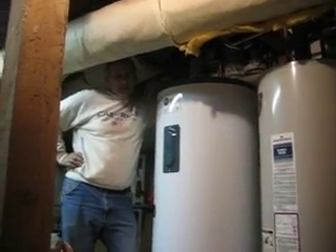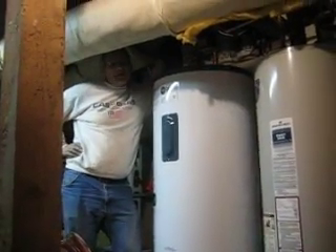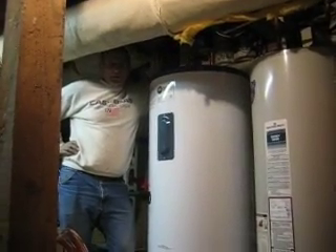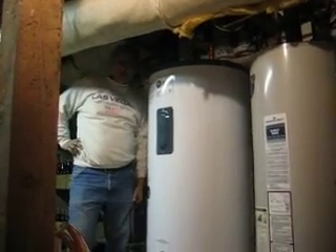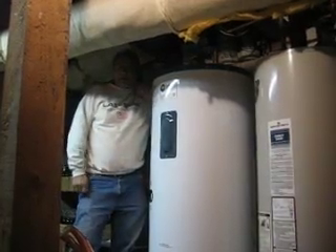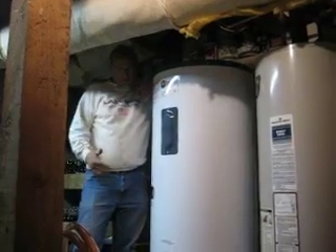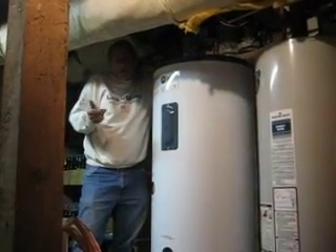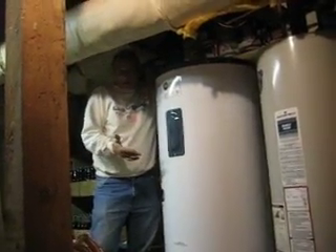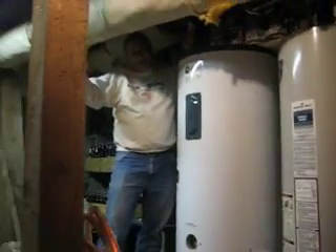Sometimes I'm just taking showers with warm water from the sun — it's carried over from the night before. But if you have a lot of people in the house, it makes a difference. I'm totally 100% solar in my house, I don't use backup. If it's been cloudy for a couple of days in a row and my water temperature has gone down, there's still 80 gallons of lukewarm water in there, so I just take a real quick shower. The next day I've still got enough for a quick shower, and then usually the sun's out again and I'm back in business.